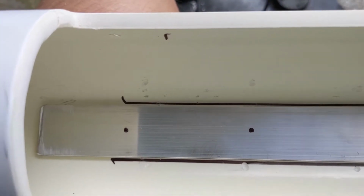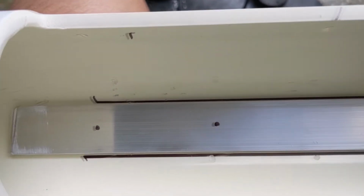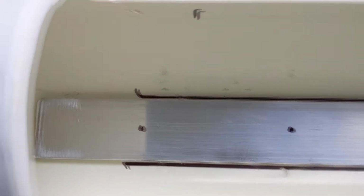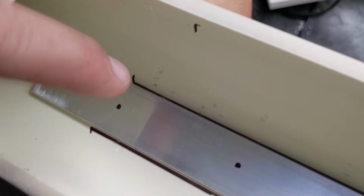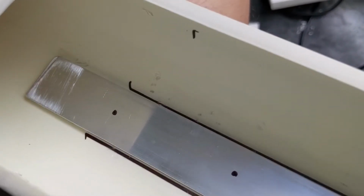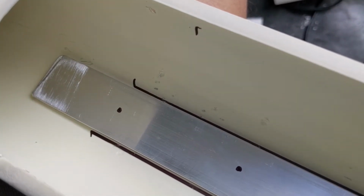And that aluminum plate's going to provide rigidity so they're not bending and warping the washer. So once it does that, it'll make it difficult to tighten it down with the socket. But with this plate, it's a nice flat surface for the washer and nut to mount onto. And so that way I can use a socket wrench and get it nice and tight.